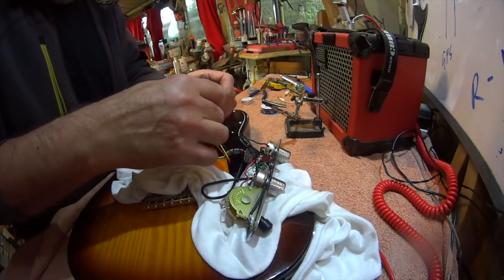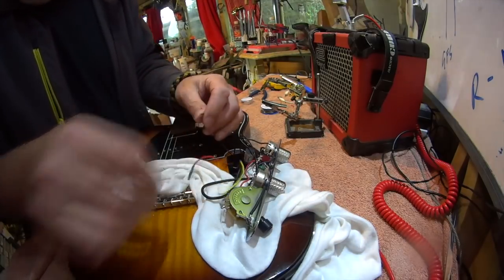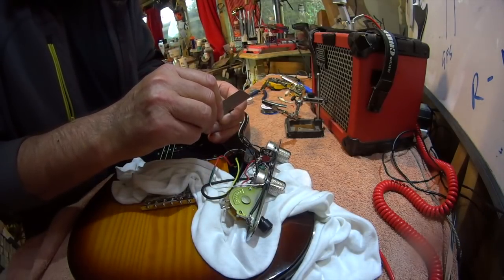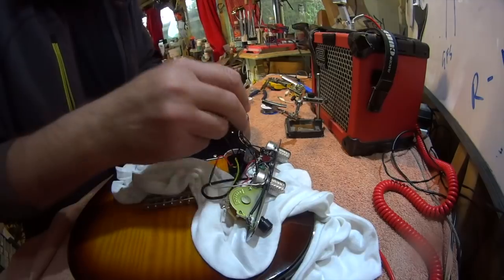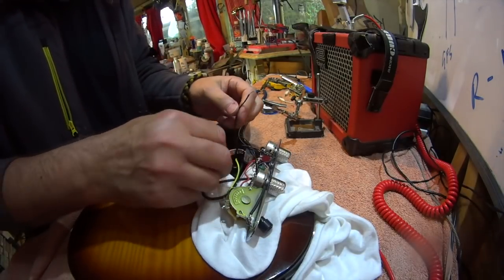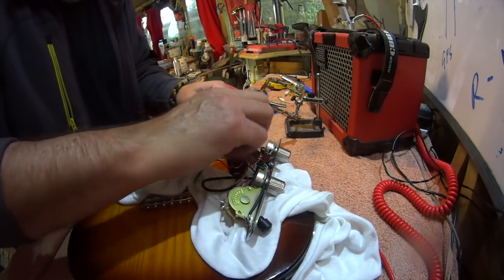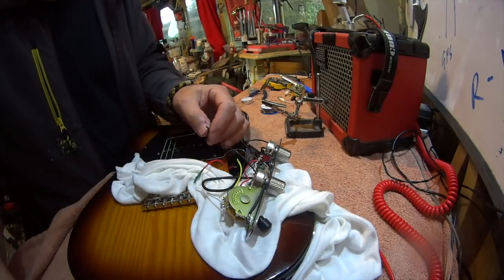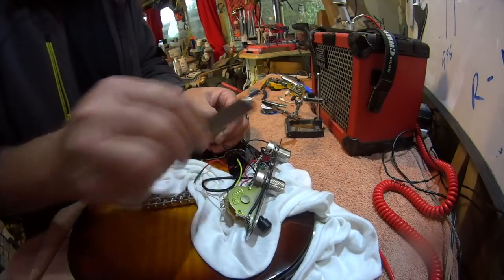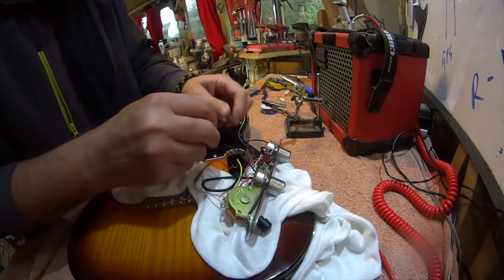Okay, so I could probably tell with using my multimeter which pair goes with which. I really could have done without all of this extra fiddle. But the point is, each of these earths is going to need to be extended to reach the switch if we're going to go the opposite way round to switch these to become live signals. It's just the opposite end of the pair.